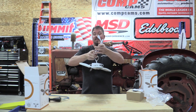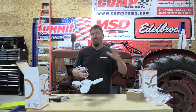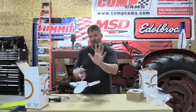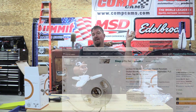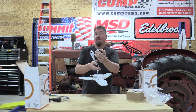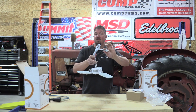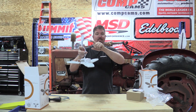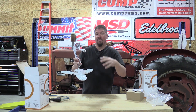In our case we have a workbench in the other shop that isn't used often, but when it is, it's absolutely horrible — dark and dim. Even with the other lights, you're casting a shadow because you're in a corner two feet from a wall. In that case, I'm going to buy a light outlet that has a pull chain and a plug. You need a three-prong plug — I'll link to it in the description. I can leave that pull chain pulled, plug this light into it, and when I flip the light switch, both that light and this one will turn on, giving me a ton of light directly over the workbench.